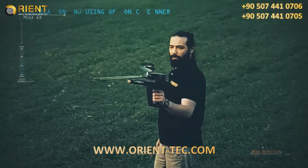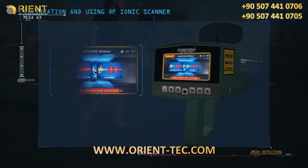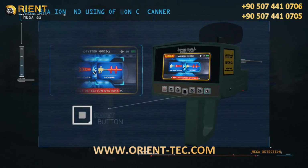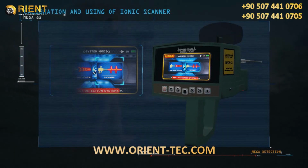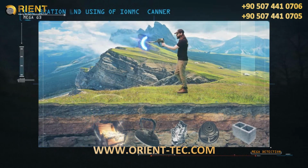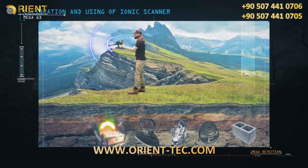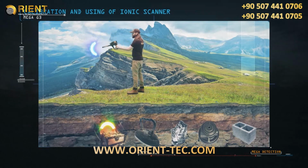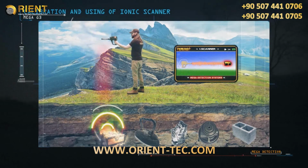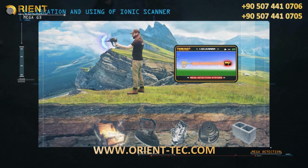Calibration and using of the Ionic Scanner. When the device is turned on, please select the Ionic Scan system from the System Selection screen. When starting the system, please reset it first by pressing the Reset button. After calibrating the device, start moving left, right, and slightly up and down a few times as you walk with the device. When the device detects a target, it will make a synchronous sound alert with the appearance of vibrations in the search screen. The more powerful the signal, the higher the sound alarm and the more vibrations will be on the search screen.